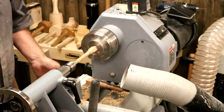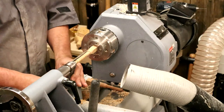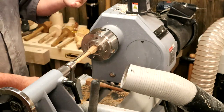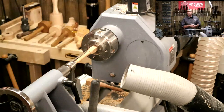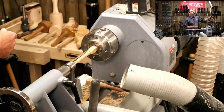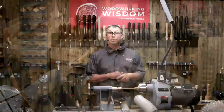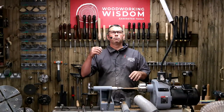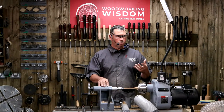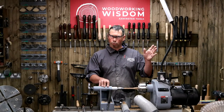Yes, Craig. Maria says, thanks for the answer. What oil for soaking? Well, anything. Finishing oil, I guess, would be the best one. But to be honest, anything would work. Food safe oil, lemon oil, Danish oil, any of those, really. What you don't want is using a food oil, something that's sour. Use one of your normal finishing oils.